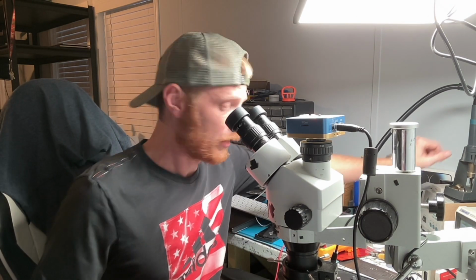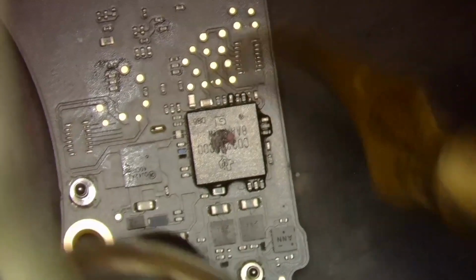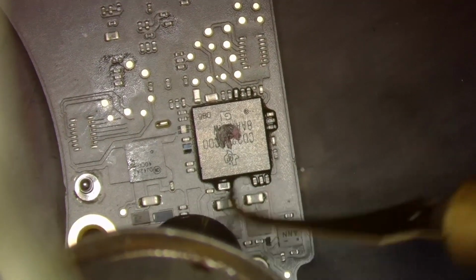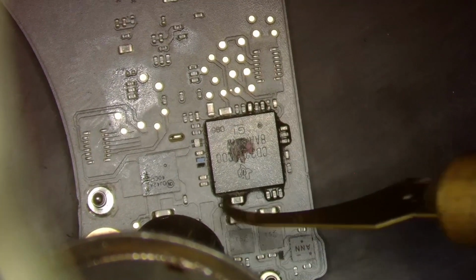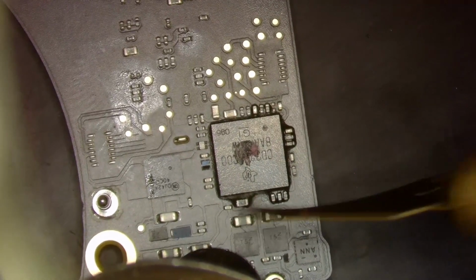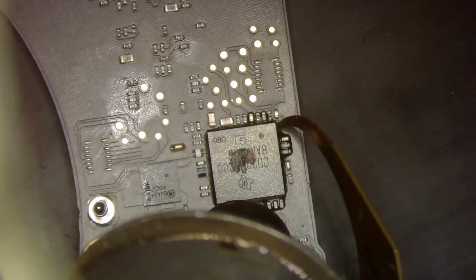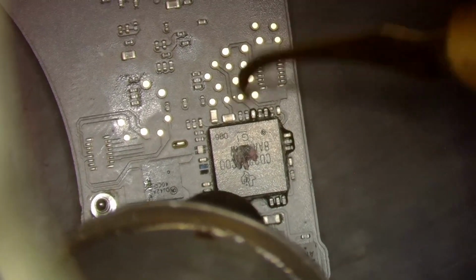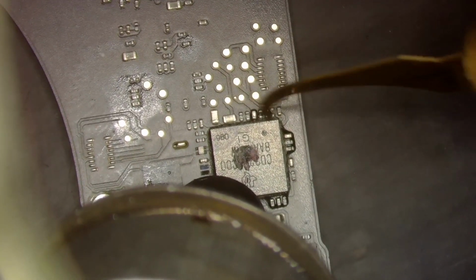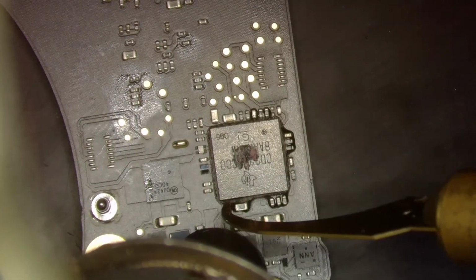So once again, we will turn our hot air down to the temperature that we remove underfill with, and we will do the same exact thing that we did on the other side of the board. Hopefully we will knock fewer components off this time and not more, right? That's our goal, to knock as few components off the board as possible. And I don't care about ripped NC pads, or not-connected pads. Nobody cares about those. Those guys can go home.